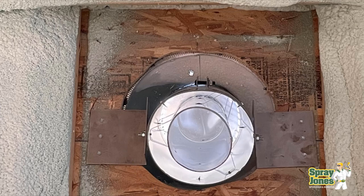The thimble gets cut through the roof deck, a rough opening is cut, and the thimble is placed. Someone suggested packing this full of rock salt, sealing it with tin and high-temperature caulking, then spraying up to the tin and no further. But if I've got four or five inches of closed cell foam and I stop at this spot, I've got only rock salt as fill — totally reliant on metal flanges. How are you going to air seal it? It's a huge weak spot. If it condenses and gets wet, it could damage that section of roof deck over two, five, ten years.